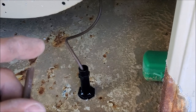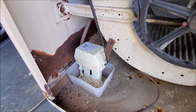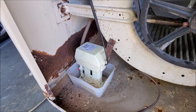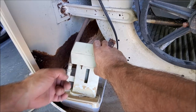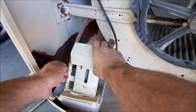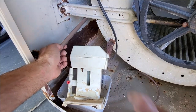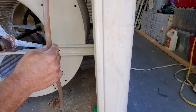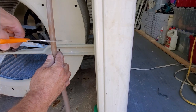Now we're going to show you another way of connecting a bleed if your pump doesn't already have a valve on it. We're going to go back to our swamp cooler pump, and if yours doesn't have the bleeder valve, we're going to go ahead and disconnect our line over here. Yours might possibly have a hose clamp — if it does, go ahead and remove your hose clamp. This one doesn't, so we'll slip it off. Here's our hose right over here. Pretty much whatever you have to cut it with — a razor blade, scissors — we're going to go ahead and cut it here.